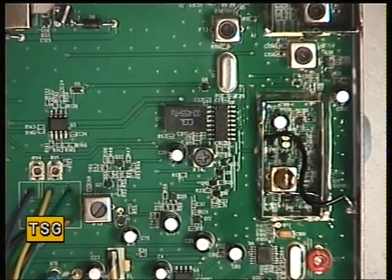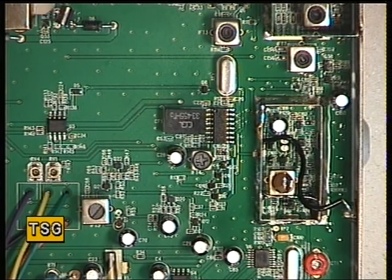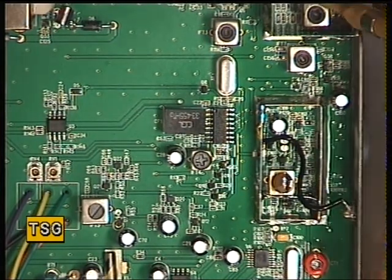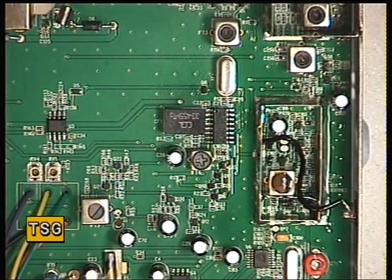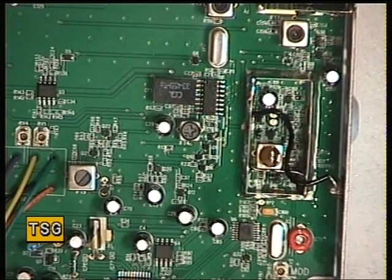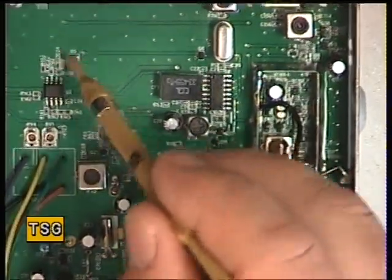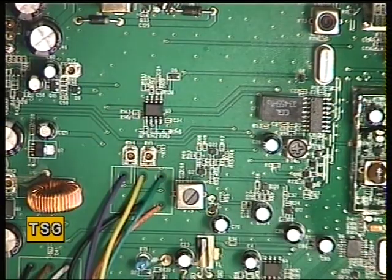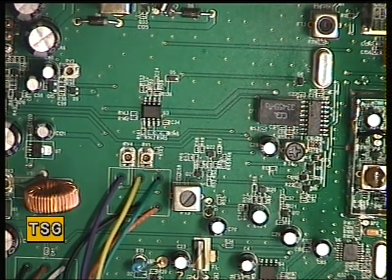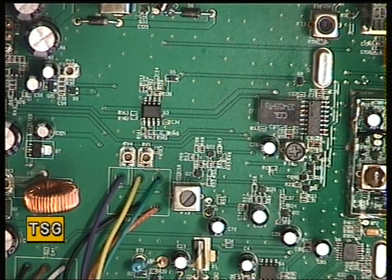And that's it. There's no power meter on this, no meters at receiver, with it being quite low in the range. So basically we needed to make sure the transmitter was tuned correctly with that coil. I checked the other coil not shown on the circuit. The frequency adjust trimmer would be there if needed. I've adjusted the FM deviation at RV5, the radio's power at RV3, and AM mod would be RV2 — we're not touching that as the customer won't be using AM mode, even though AM does become legal in the UK on the 27th of this month — June 2014.